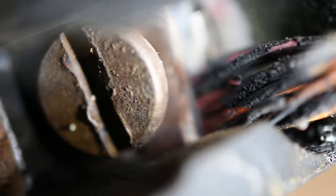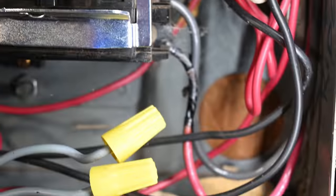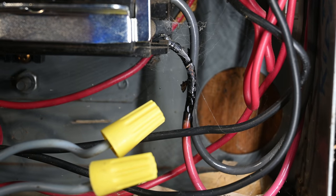What can happen with a loose connection is you may run into a situation where it could overheat and cause the insulation on the conductor to fail. We're going to be diagnosing this particular breaker here, which has that exact scenario. This breaker is for an electric water heater. We did all the troubleshooting steps for the water heater, but it was still tripping the breaker after about 10 minutes. After opening it up and inspecting it, there's a burnt wire on this breaker that was causing everything to overheat to the point where the breaker was tripping. We're going to replace the breaker and use our torque screwdriver to fix this problem.